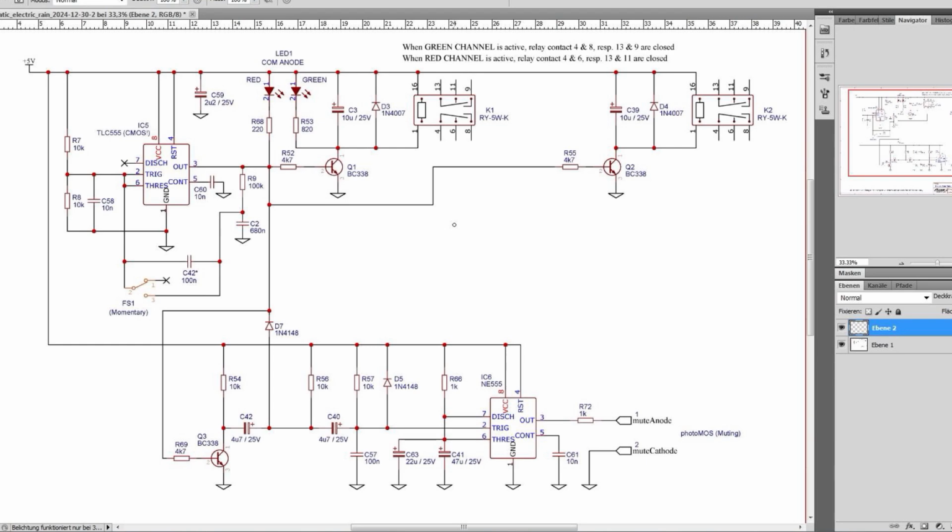Of course, this can be solved in many different ways. This is my way. As told previously, the big problem when switching signals is that in general they are often on different voltage levels, and if you switch them, for example via relay, you can hear an annoying pop sound in the speaker. This can be solved by muting. So this circuit addresses 2 objectives. First, switching the channels and give some LED output. Second, while switching, muting the output signal by pulling it to ground.